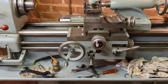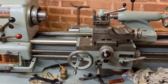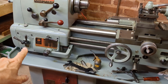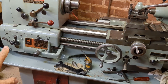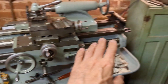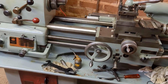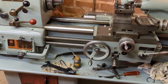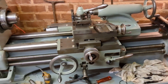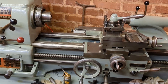What I find is that you can't think to yourself: I'll level the headstock and that will be finalized, then move to the middle, then the tailstock. No, it doesn't work like that — you have to iterate around, because whatever you do at any point seems to affect everywhere else as well. So with a bit of patience you can finally get all three points level.